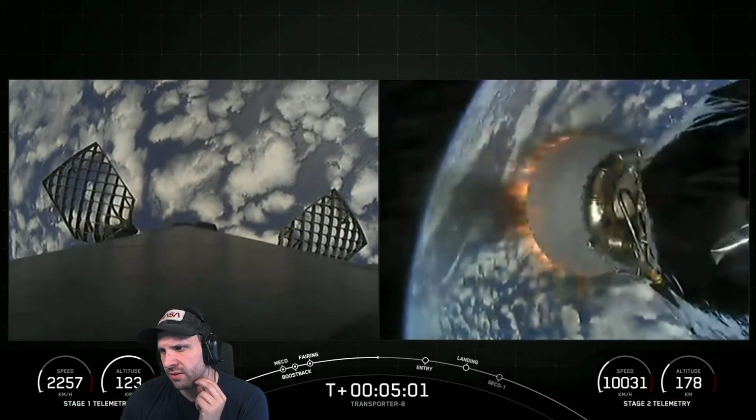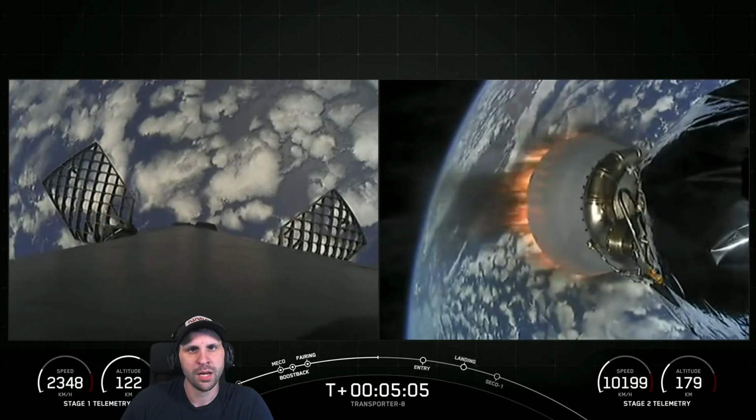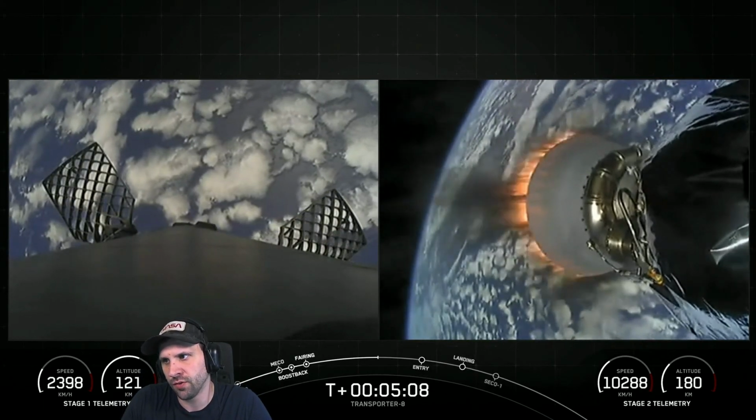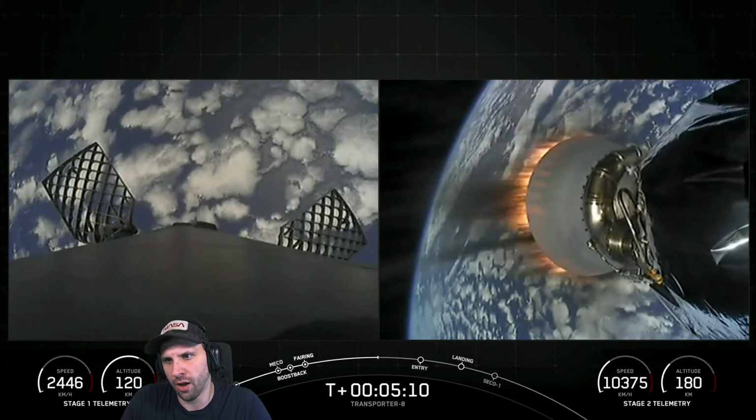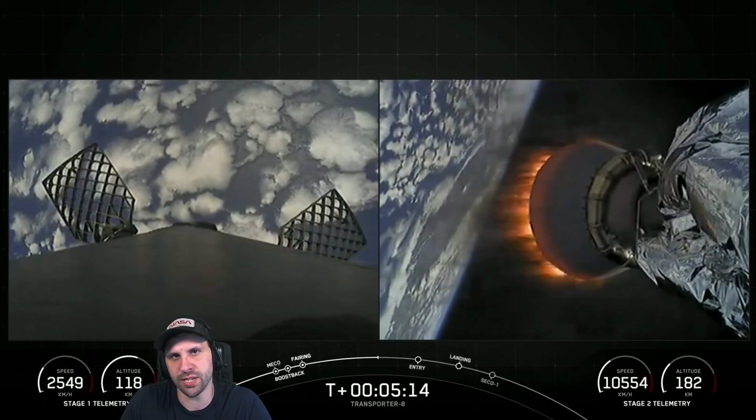Does that smaller nozzle aid in performance? No. You're going to take a huge specific impulse hit from that. But you're also probably noticing some white puffs of gas from the first stage. They do it because they don't need the performance. They'll take the efficiency hit to save some cash.